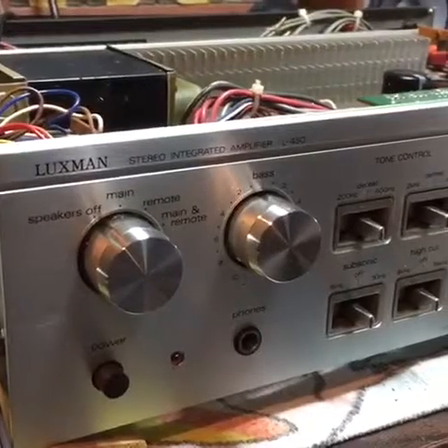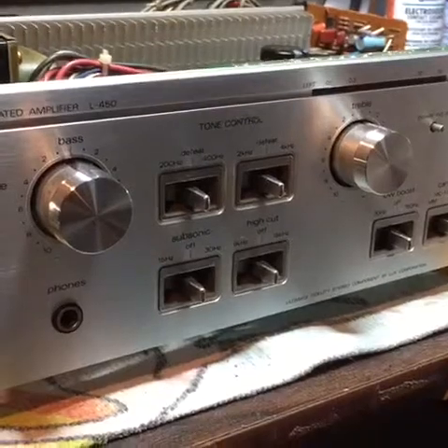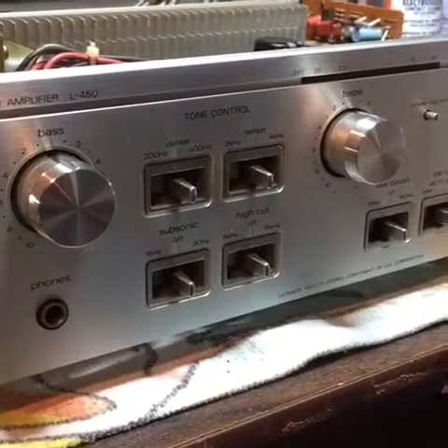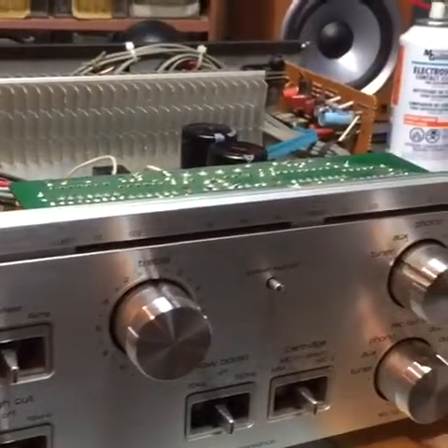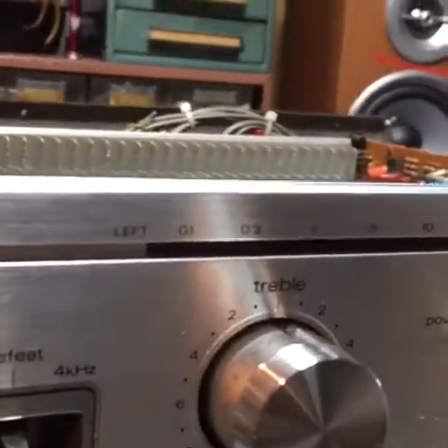The units are meant to slide into full wooden cases, so you can't just stick your hand underneath and electrocute yourself. When disassembling the L450, if you go to remove the faceplate, be careful particularly with the center toggles — they're made of plastic with a chrome cladding, not real metal. If you break them, you likely won't find a replacement. When refitting the face plate, if it's not fitting properly, it's probably because the LEDs haven't slid properly into the groove.